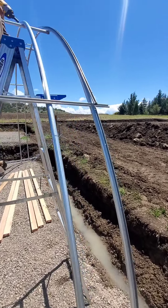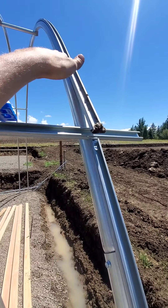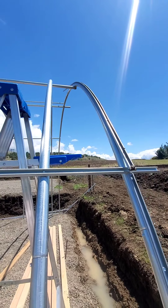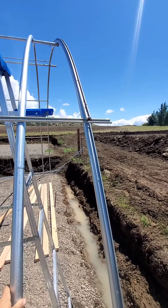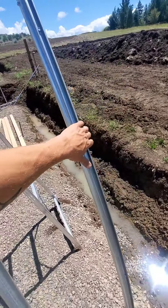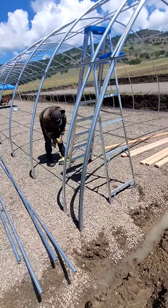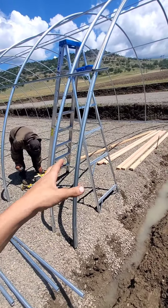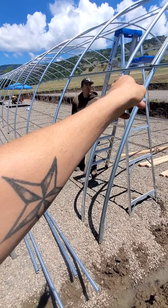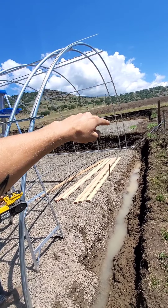We'll come through here with our bandsaw and chop this little excess off. Some people start it right here and bend it that way — put a tech screw right here and then just push the channel down as you go. Everyone has their own way. We run channel right here. Even though your clear plastic doesn't get set to this, this is where your end wall plastic will go. Your clear plastic is going to roll all the way up to this bar and down, and it stays fixed all the way up and over on each end post.